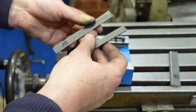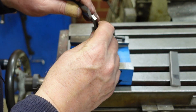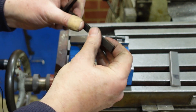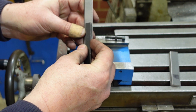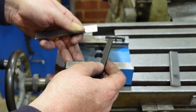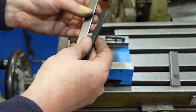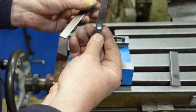For those wondering why replace the gibs — well, this is the one that came with it, and it's thinner, which means it's going to be able to deflect more. The new one will be stiffer. Also, I've got more width here now because I went to all the trouble of scraping down the V-grooves, and I want that width because that's what gives me that nice comfortable feel. So the old ones are basically useless.